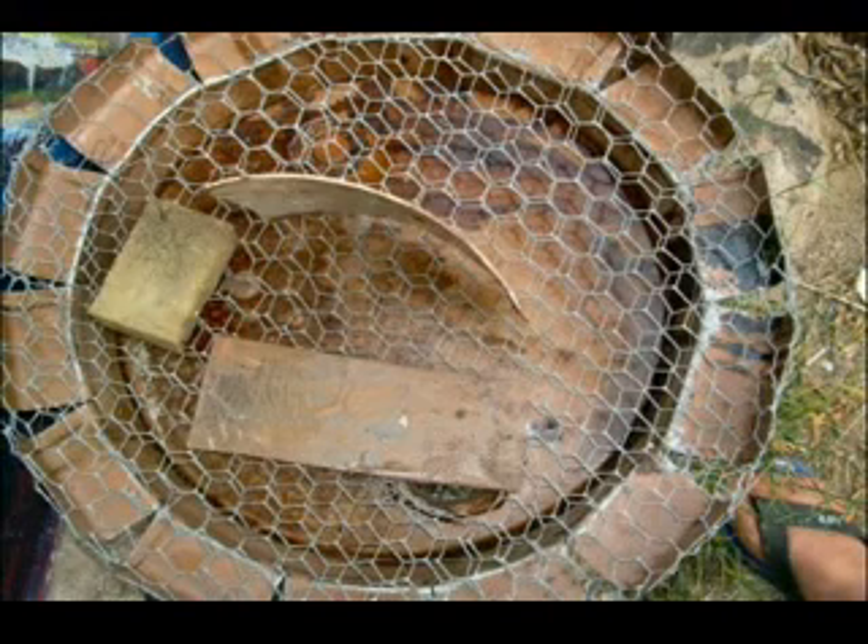Be careful with the very hot gases which are coming out of the chimney. My first experiment was that I put some blower — a hand blower, a bellows sack — to put some oxygen into the burning. The temperature went so high that the tube of the blower, which was aluminium, melted. In the ashes I found some pieces of clay which broke and were also melted. I think that the temperature was higher than 1000 degrees.